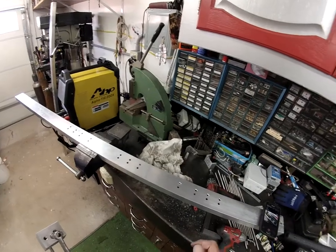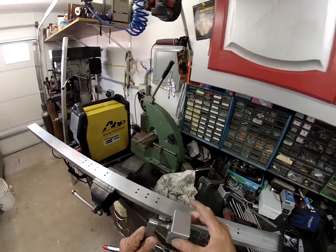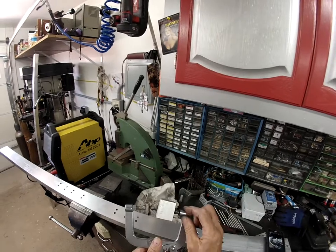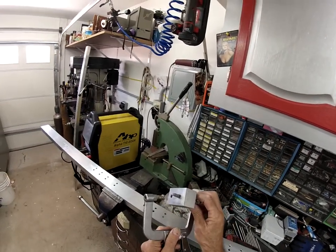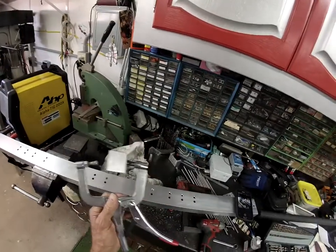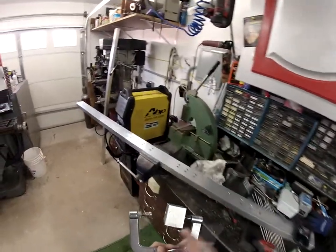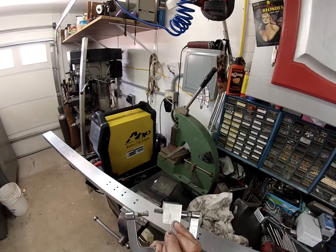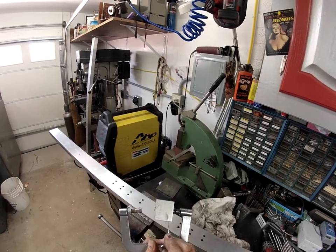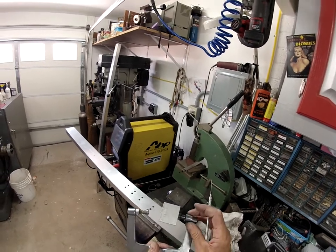I looked around for a long time and couldn't figure out how I'm going to get them all straight, and they all have to be about the same depth as well. So what I did is I came up with this little device here. I took a block of aluminum and I took a seven millimeter socket which just fit over my tap - you can see that's an NPT tap. I drilled a hole in here to the point where in the middle, from the depth of the threads, the diameter matches the shank of the tap. From that point onward is the diameter of the socket, which I turned down on the lathe.